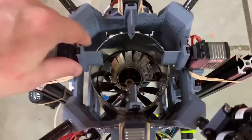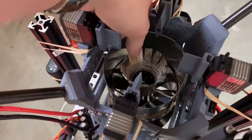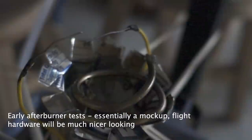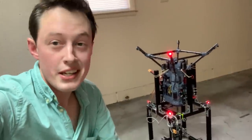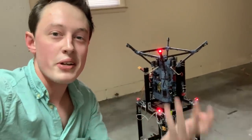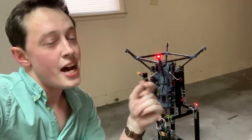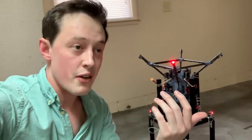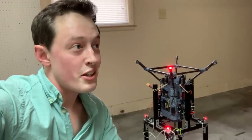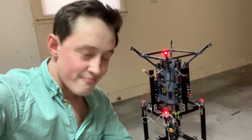We're basically just running the thrust vanes straight through the fan to see how this performs. This is an incredibly rough and not securely mounted sort of low pressure zone generator for this afterburner. I'm not a propulsion engineer by any means, but that basically allows us to have a stable combustion zone to get that butane lit and start shooting flame out the back. The goal is not to have any appreciable thrust increase from dumping all of this butane out the back — other than a small amount of changing mass, so it is kind of like a rocket. We're losing mass and have to change our nominal thrust to hover as the vehicle flies. And part of it is just — I want fire coming out the bottom of this thing. Butane when you burn it makes fire. That's it.